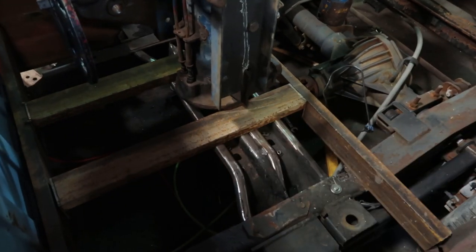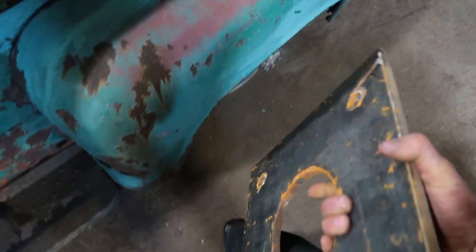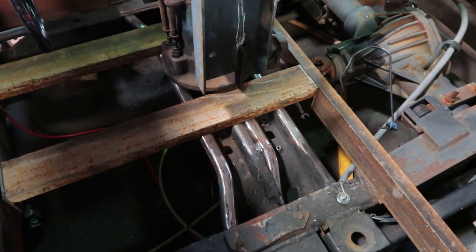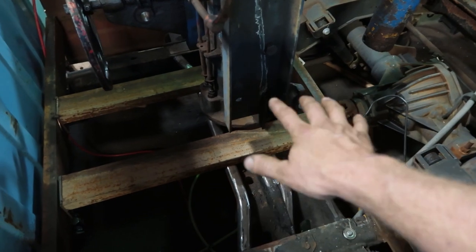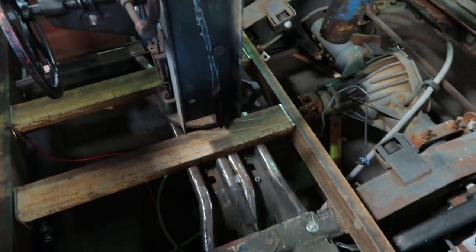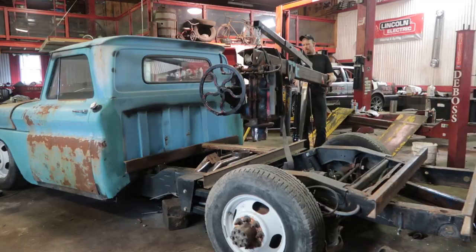That is just sitting in that pipe — the turret — whatever is just sitting in a pipe right now, it's not actually bolted in. So I cut this plate. This is a half-inch plate with three-quarter inch holes. This will fit around the pipe and then get bolted to these ones. I made it so we can still remove the box — all we have to do is unbolt the frames here. It's sturdy this way. When we weld it solid, it'll be sturdy enough if we want to swing the boom over to the side and pick somebody out of a ditch. Either way this will be plenty strong. For now we're going to take the turret back out again, take the box sides off, and start welding everything solid.